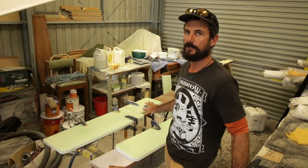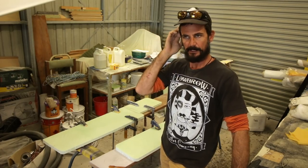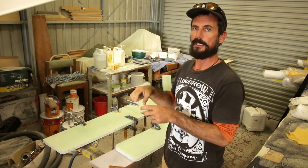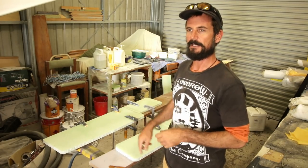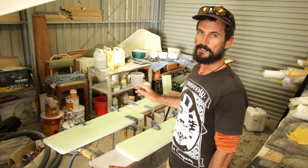We've put the thickened epoxy in now, and that just fills up the gaps so there'll be no leaking down in there. It's not actually acting much to glue the two together — we're going to have fiberglass on top and bottom, and that's what we're doing now. We're going to get the actual fiberglass, put it on, and wet it out. That'll be left tonight, and then tomorrow it gets flipped and the other side gets done the same. We're putting it on while this is still wet so it's a chemical bond — molecules can interact with each other and you get a much stronger bond.